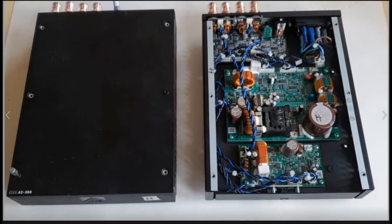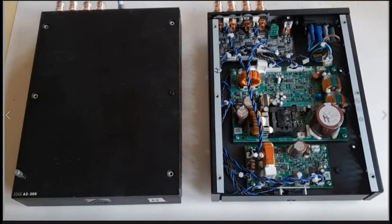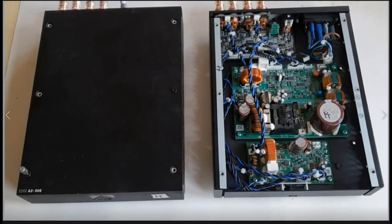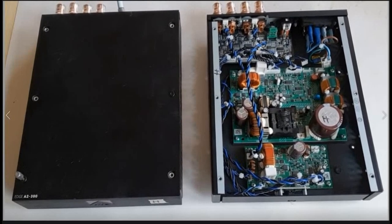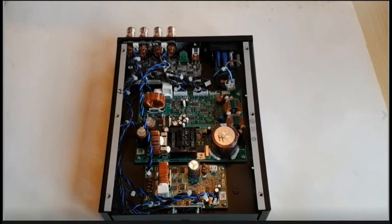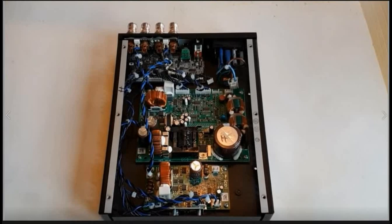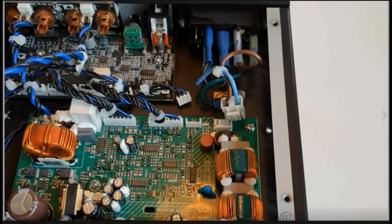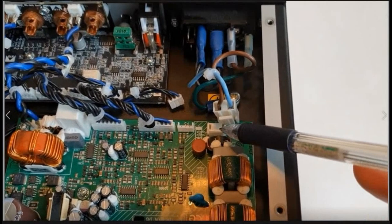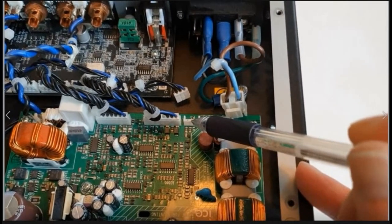Now let's have a look at the alterations I've done to the amplifiers. To be able to perform these alterations you have to remove the covers, which are held in place by means of six screws. With the cover removed, the inside of the amplifier looks like this. Fortunately these amplifiers are very easy to work on, so there's no problem removing the four boards located inside the chassis. Start by removing two terminals: this one for power in, and this one for the lights in the front of the amplifier.